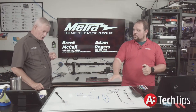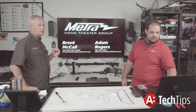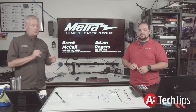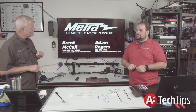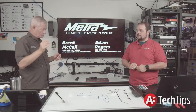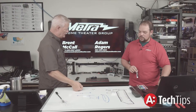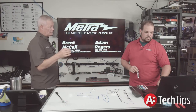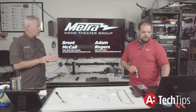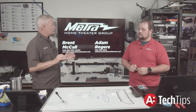What do problems look like? Let's start with five-volt. A bunch of years ago, we created a product called the VI2 — voltage insertion. Its purpose was specifically because of Sharp televisions, which had an issue with having enough voltage and current to support the hot plug. We also had to give it a solid five-volt door knock, and not every device was even hitting 4.7 volts — you were seeing 4.3, 4.4, 4.5. Some displays were fine with that; some were not.